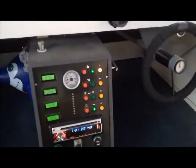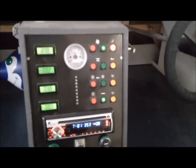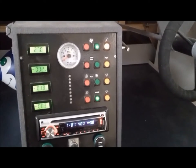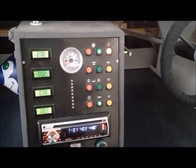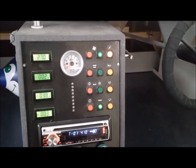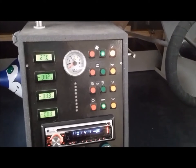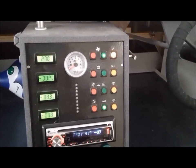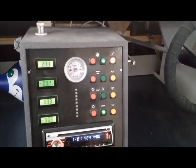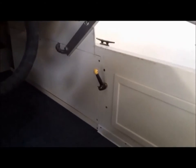Here we have the dash with all kinds of buttons — switching on the main relay, the main power relay, switching on the main motor relay. I have a voltage indicator and various current indicators showing the solar current, the motor current, and the battery current. To switch on the motor, the throttle needs to be in neutral position. If it isn't, I see a red light which disables me from engaging the motor.